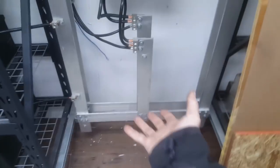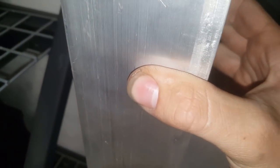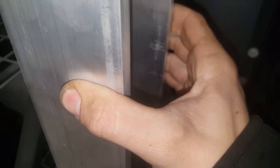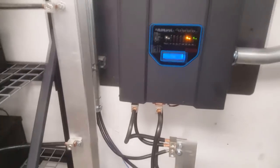There's no kid that's gonna bust through the door, come in here, and touch the bussing. And if they do, what happens? As you can see, I am making firm contact — absolutely nothing. You can even see I was making contact. It's 48 volts — it doesn't have enough oomph to break down your skin.